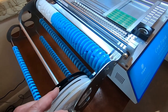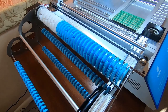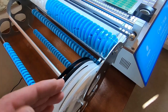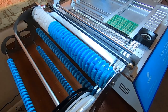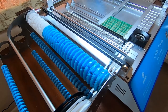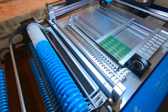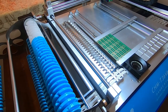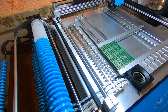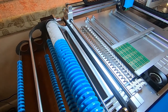You have to manually feed in each reel by hand. If it's a component in the middle that you want to change, you're going to have a bit of a struggle. Having said that, you don't need to place them consecutively — it's entirely up to you which station you put which components in and they don't need to be consecutively numbered. There are advantages to having them close together which I'll go over in another video. It just takes longer to set up and longer to change jobs, but if you're using it for small production batches or many boards with the same components, that's not a problem at all. You just load up the most commonly used components in whichever station you have free and you're good to go.